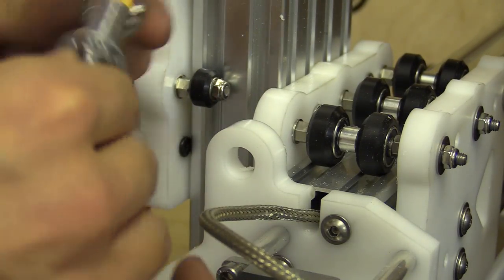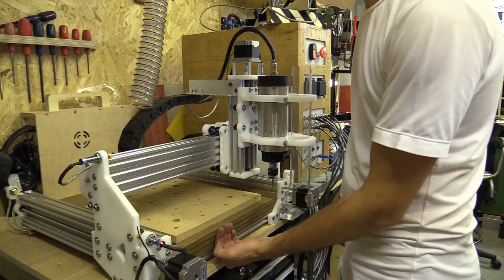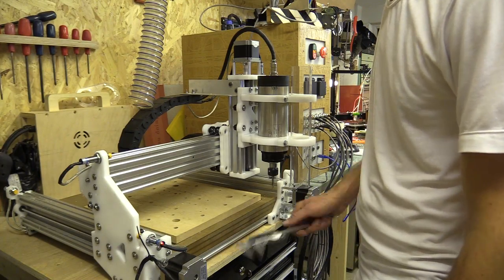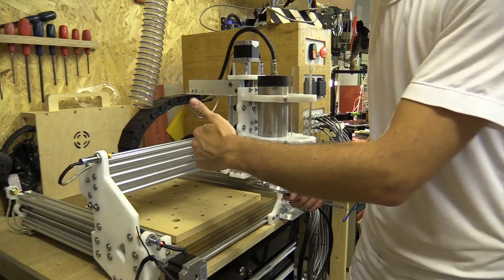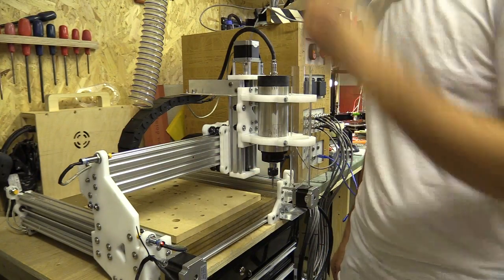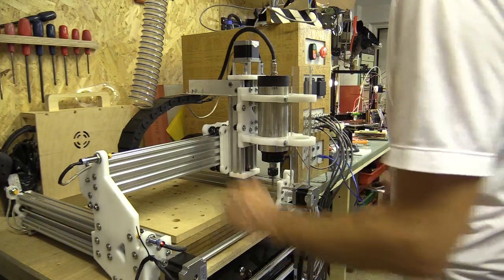The new design of the plates along with the narrower spindle mount has increased the cutting capacity of the machine. The bit is now overhanging about 15mm, so I should be able to pull it forward and do some finger joins on 9mm or 12mm material. If the bit is a bit bigger I might even get through 18mm. From the home position, moving forward until the red light turned on, I counted 33.4cm — already bigger than my current waste board which is 32cm.